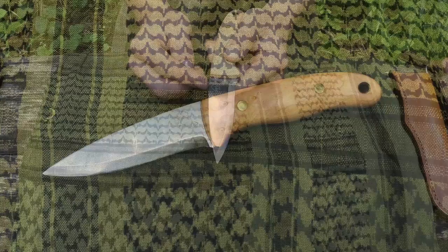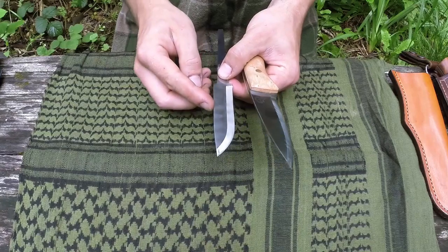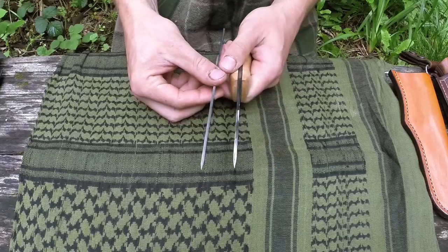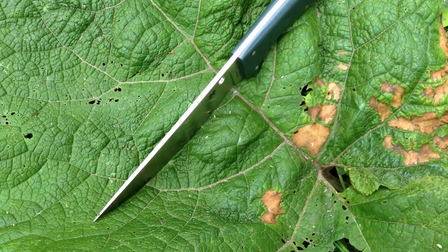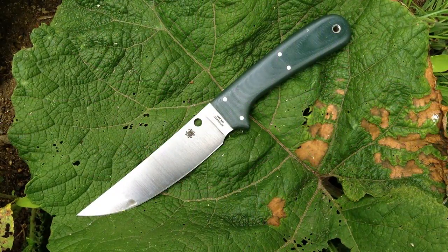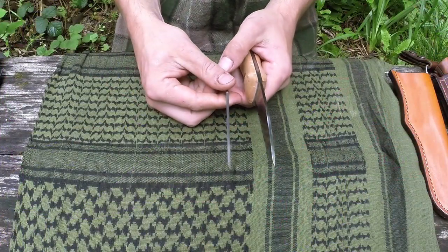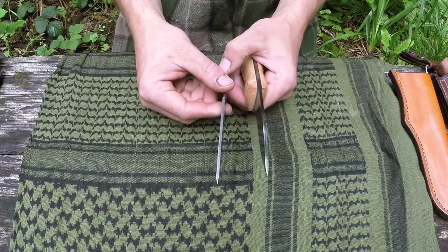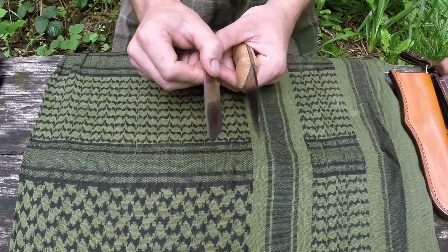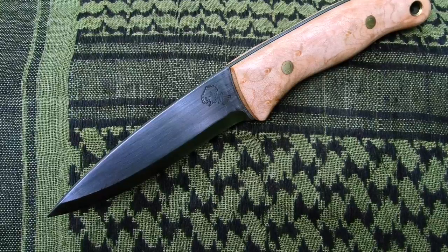Just there we have what I'd call a drop point on the blade. On some knives you have a very straight spine and then it drops off slightly into a drop point, which makes the point a lot stronger. On some blades you can have a tapered spine or tapered edge that narrows off towards the point — that might be good for something like a filleting knife or a skinning knife. But on these knives here they're about three mil all the way to the edge where you start to get to the bevel, simply because it makes them a lot stronger for heavier jobs.